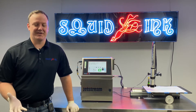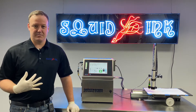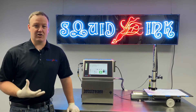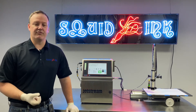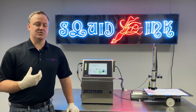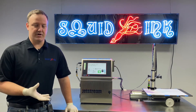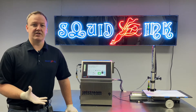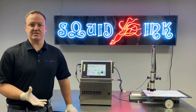Some of you might be wondering first, what are we doing when we're adjusting or calibrating our modulation value? In a very basic sense, what we're doing is adjusting the breakpoint of our inkjet in the printhead from a solid stream to droplets, and where those droplets separate from the inkjet. Ultimately, why we have control over this and why we can adjust the modulation is we need to have that separation or breakpoint inside the charge tunnel in our printhead. What that does is guarantee or help us achieve good quality print by getting a quality charge — the correct charge — on our droplets that we're using for printing.